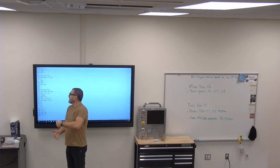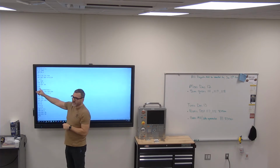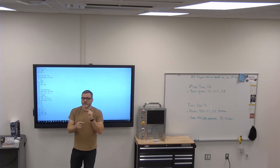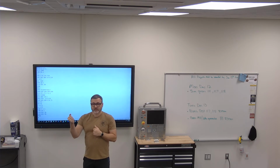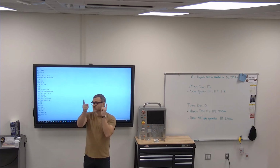So we're going to go all the way up, then we're going to switch back to G90. G90 and G91 are modal commands. Modal means it stays that way until it's changed. Just like you put your car in drive, it stays in drive until you put it in reverse, right? So it'll stay at the top as far as it'll go up until we do the tool change.